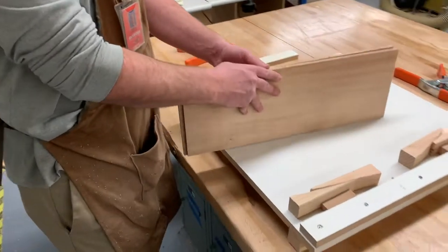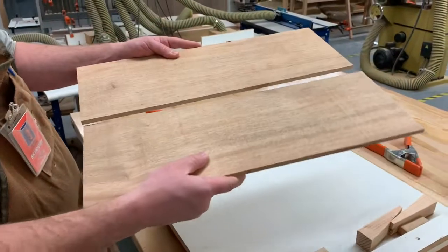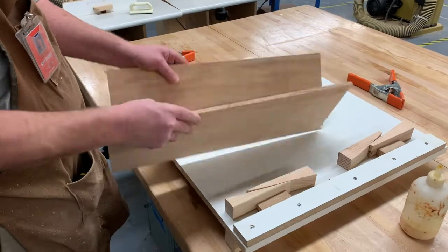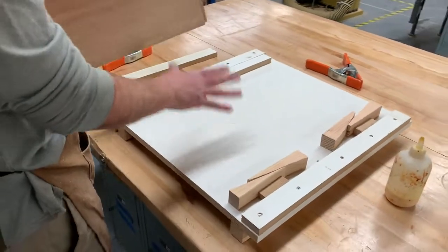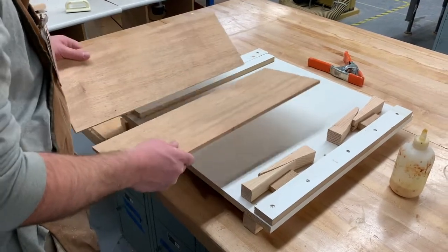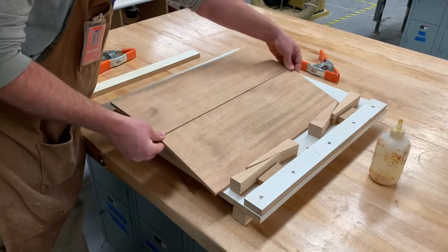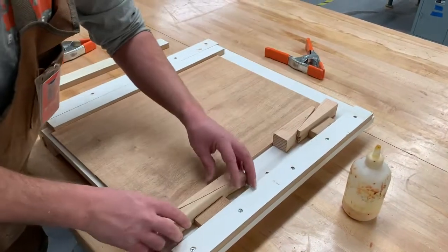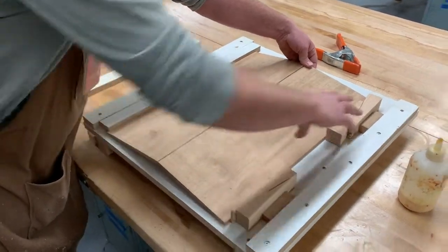When you go to glue these together, we want that book match style. These boards are thick enough we could use bar clamps, however some of these can be a little thin and the boards might spring up. So I've got a little jig to help glue these narrow panels together — we'll do this for your back and also the front of your guitar. On this jig you open up the panel, put glue on your two inside edges, and use these little wedge blocks to tighten up and put pressure on the joint.